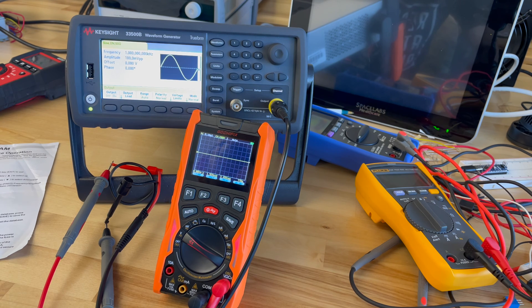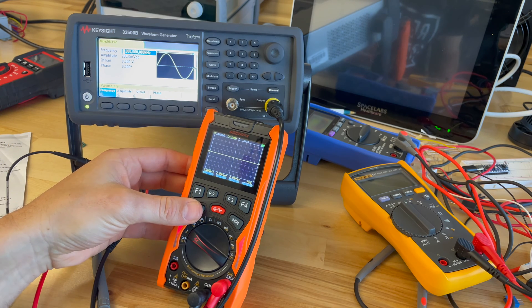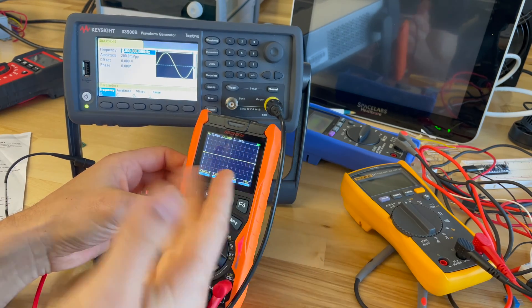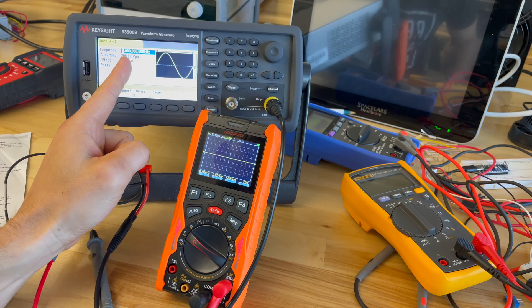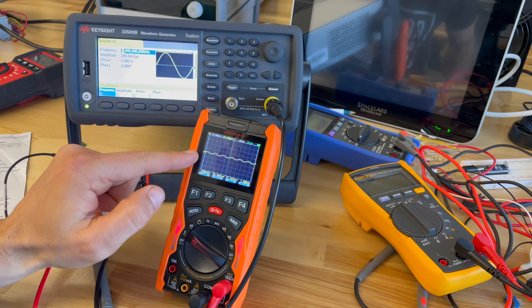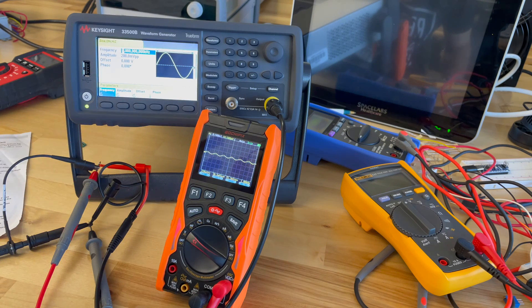Why is nothing showing up? Where's my auto set, my auto scale? Once you're in oscilloscope mode, you hit auto and it should try to auto-detect where the signal is, figuring out settings to give you your signal. Right now I have channel two set to 200 volts, and since I'm generating a 200 millivolt peak-to-peak signal, that's probably an issue — but let's see if it finds it. All right, I am getting my wave: a 220 millivolt peak-to-peak signal.